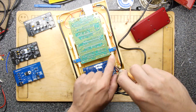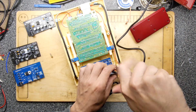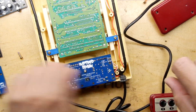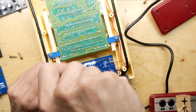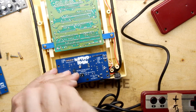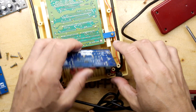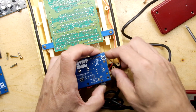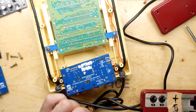If you've got the same model of Famicom it will be pretty much the same process. You will literally just substitute this board for the actual standard modulator board that comes in it. I do have some really early revision boards. I've used those for initial modulator tests on Famicoms from Japan — you don't really need particularly good filtering on the composite, you just want any output to see if they're dead or alive.